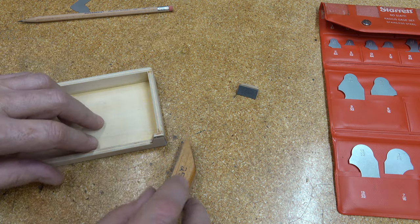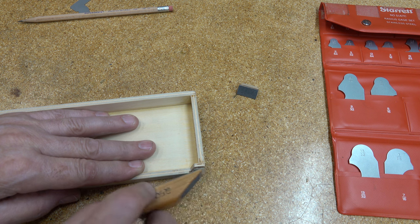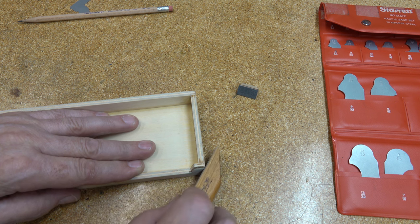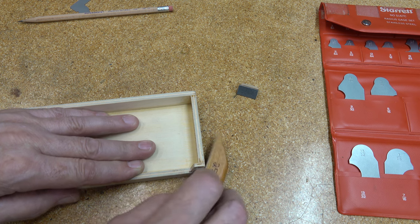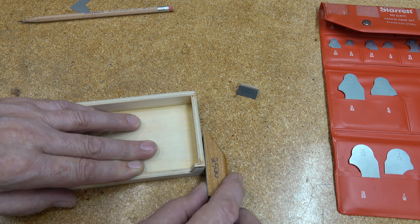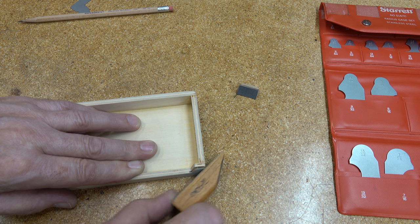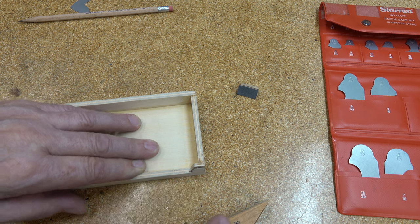Again, if your sanding block has a good 90 on it, you can start getting that in place doing this. And never do this, by the way. You're just putting flats on. Always keep that radius going while you're sanding, and do your last little bits last. Don't even touch those till you're all done, because that little bit takes so little to sand off, and if you do it early, you're going to do too much on it. Spend your time where you need the meat taken off. Again, do the others last. And keep playing the game.